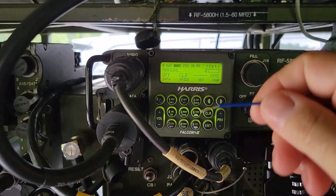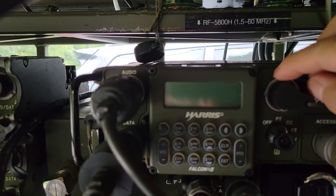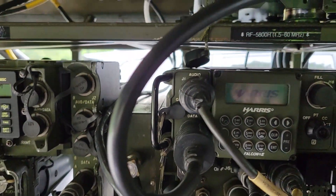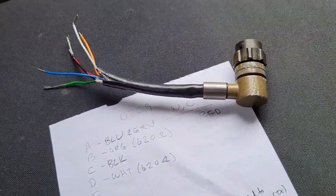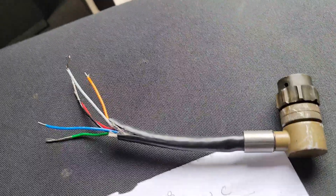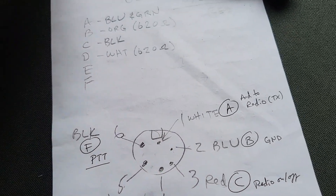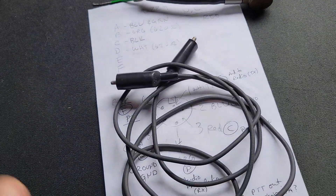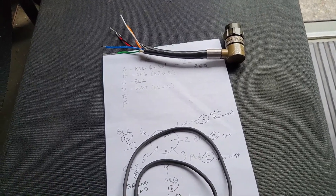We'll just show that again. We're going to short this wire to ground - turns it off. And lift the wire - and it boots up. Great. So the next part of the experiment: we're going to take this cable - a cut spare cable I had - and I've already figured out that pin C radio on-off is the red wire here. We're going to use an alligator clip wire to connect the two up, and let's see if we've gotten this HF radio turning on and off through the VIC system.